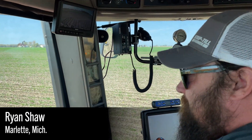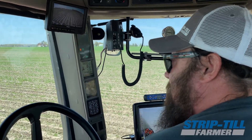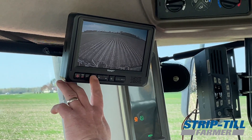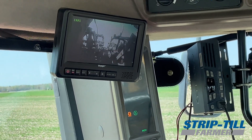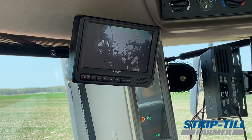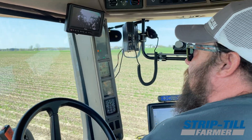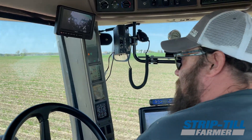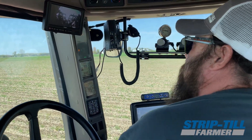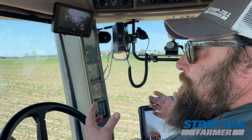How do you use precision technology to make strip-till work? We're using RTK steering on the tractor. We put a camera up to see behind us, mostly for going down the road, but also one down between the rows so you can see if you're blowing the row out or throwing the trash too far. Going fast, no one can run alongside it, and if you're here by yourself it really helps to make sure things aren't boiling out of the berm.